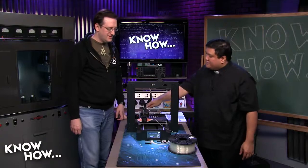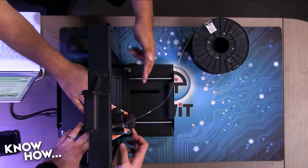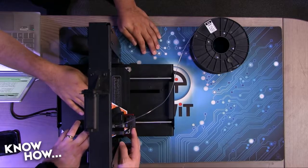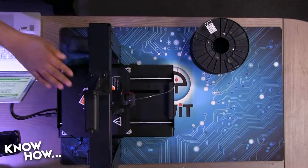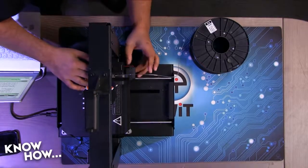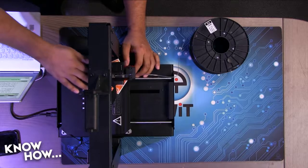This corner didn't want to touch at all — I'm betting it'll touch a little now because we've adjusted the other sides. Remember how in the first pass it wouldn't touch at all? That's because the other screws were retracted all the way. I typically do three or four coarse passes, then another pass that's really fine. My criteria there is: if I turn the screw one complete turn, I need to do another round. That was 12 turns — any time I'm doing that much turning, I've put the other corners out of alignment.